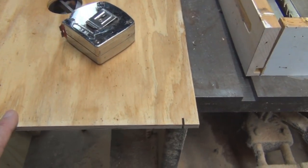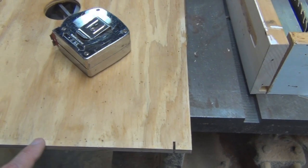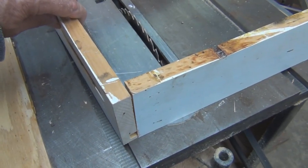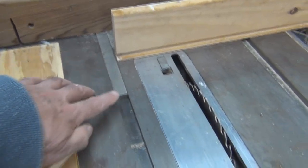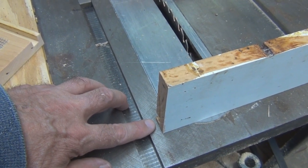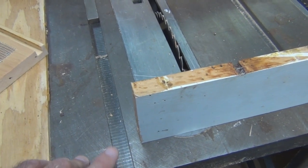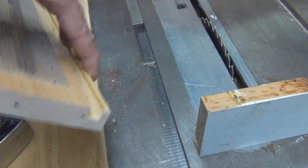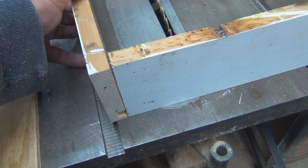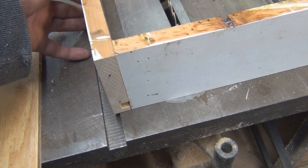I just need to cut the plywood now. I think I need to take off one and three-sixteenths from each side. I put the boards together and measured the inside of the slot from both ends — it measures 13 inches — so I'll give that a try; I can always trim off a little extra. One thing I didn't account for is the slot: the plywood is going to fill that up. I could use silicone or wood putty to fill it in, but it's not that critical.